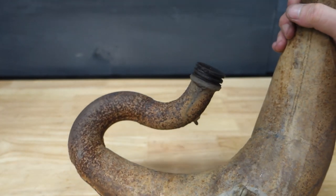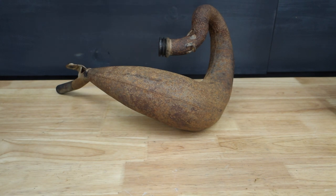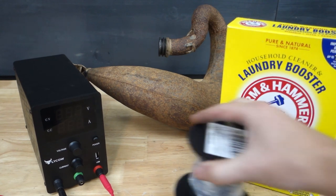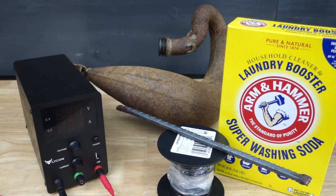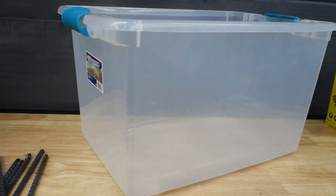What we're going to do is use electrolysis to get this rust off this pipe. I had to pick up some supplies for this: a really cheap power supply on Amazon, some super washing soda, some solid copper core 12 gauge wire, and some one-foot lengths of rebar. I'm going to be using a storage tote for the container — the pipe fits in here nicely, and I had a couple lying around.